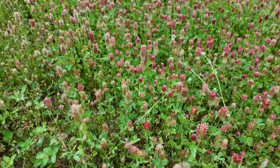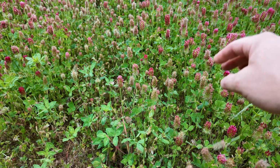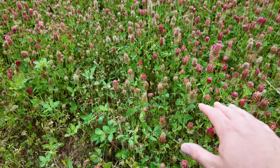And what you want to do is just knock the top off because that will stimulate the plant for new growth. And a rotary cutter does a very good job of that because you have a guide wheel on the back, and that guide wheel can really help you set depth, or those decks are pretty accustomed to floating. So as long as you're not on that much of a lumpy ground or lots of ditches or anything like that, you should get a pretty level cut.